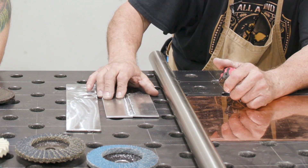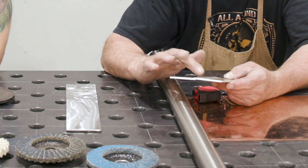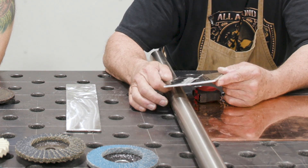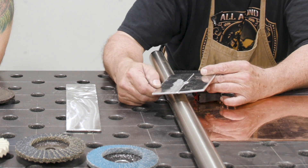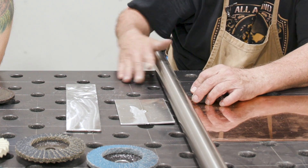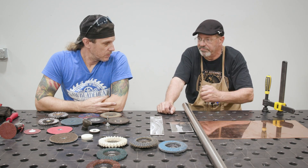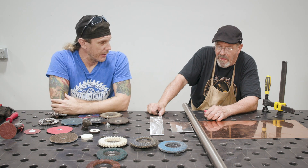Next one would be aluminum. It looks clean, but it's got the edge over here from being welded, the dull gray from oxidation, and here's where I just hit it with the die grinder and sander — definite color difference getting through that oxide layer. And your stainless steel, nice and clean. Nothing really ever happens to this. It just goes on through life looking like this. It might get dust and water stained, but it just cleans up with a paper towel.